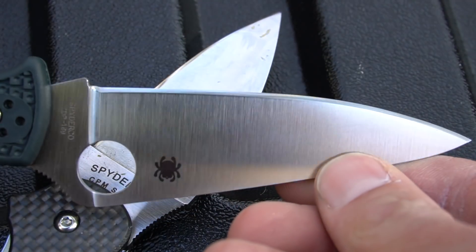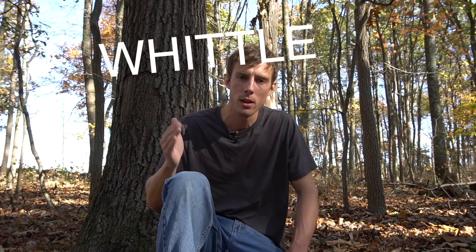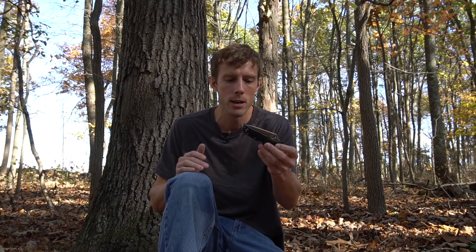Again, that's 220 grit. In about 10 minutes, we sharpened ZDP-189 to hair-whittling sharp. These are just my particular sharpening methods — this is just what works for me. If you have a method that works for you, let me know in the comments. Also — is there really a point to having a knife that will whittle hair unless you're shaving with it? Honestly, I don't really think there is. The second you use that hair-whittling edge on anything — it doesn't matter the steel type, whether it's ZDP-189, M390, or S30V — you end up destroying it and going back down to a working edge anyway. I think it's nice to know how to do it, but I don't think there's a practical point to it. Let me know your thoughts. Thanks for watching — don't forget to subscribe, and I'll see you next time.